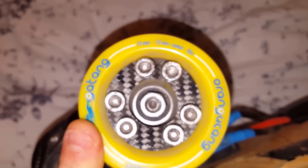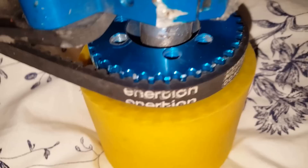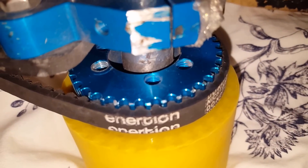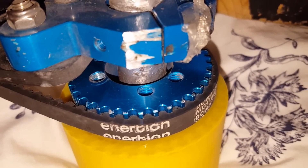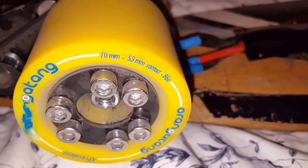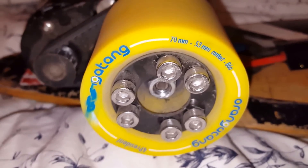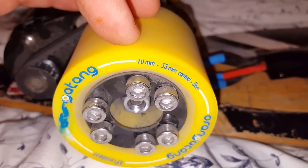They give you some kind of washer through which you need to put these long screws. They go through the wheel, all the way onto the other side, and into this gear. I absolutely recommend that you use one of these vertical drill presses — the very stable ones. You cannot do this by hand. I tried at first drilling by hand through the polyurethane and it was just impossible — I kept sliding down into the middle.